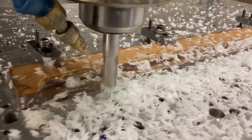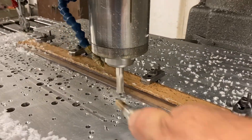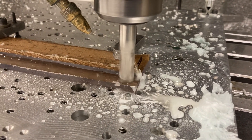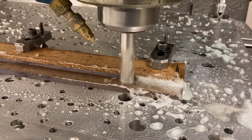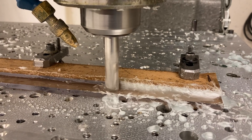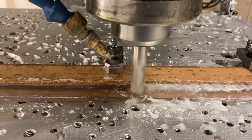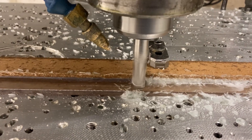It's gonna wrap back to the beginning and take its finish pass. Everything's running at 15 inches a minute. I probably could go a lot faster than that, but hey, it's only money. If the part moved or picked up or got a big dig in it, I don't have any replacement material - material was supplied by the customer. I'd look like a real jackass if I had to call them up and say I screwed the parts up because I was trying to make the chips fly for the video.